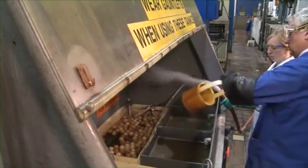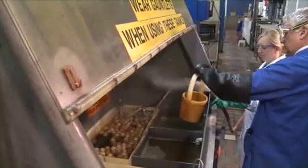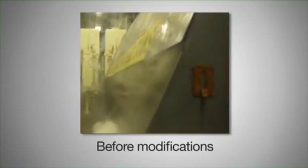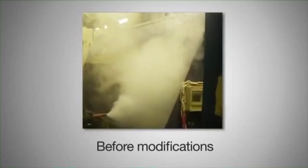The HSE — Health and Safety Executive — approached me about a joint seminar which the Surface Engineering Association were running on nickel chrome. As part of that exercise the HSE showed a smoke test using a very large smoke generator, and we put it in this particular cabinet and it showed that there was leakage around the edges especially.